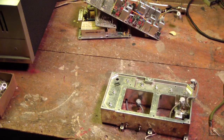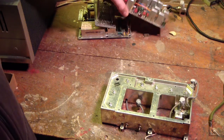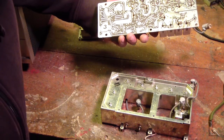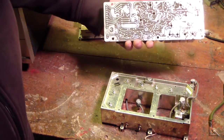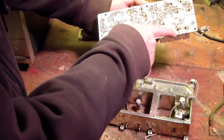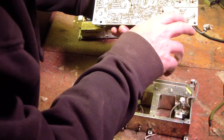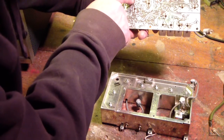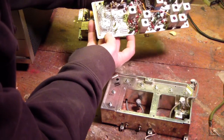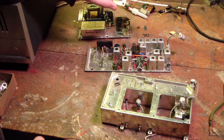One more bit on the Master II teardown. Took an awful lot of screws out of it and everything's modular — it took a while to take it all apart. Some of these boards show evidence of being worked on — some re-solder work here and here. Not very good re-solder work. A few cold joints. Something was definitely replaced there. The boards are all modular.